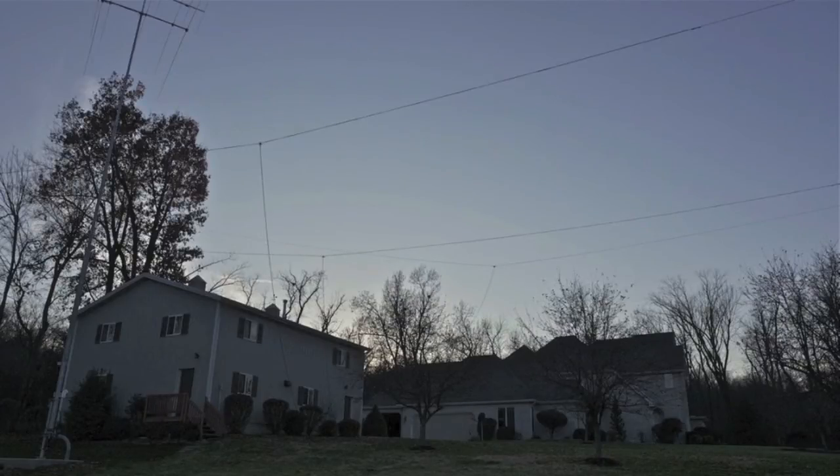There are all three coaxial dipoles operating as omnis: 160 meters, 75 meters, and 40 meters. It gives us a lot of possibilities for capturing that signal as it comes down out of the ionosphere, because you never know where it's going to be. With those antennas, operating is just so much fun. 73 everybody from Illinois tonight — this is K9EID and all the Ham Nation crew. We'll talk to you next week. Very happy Thanksgiving — we all have a lot to be thankful for.